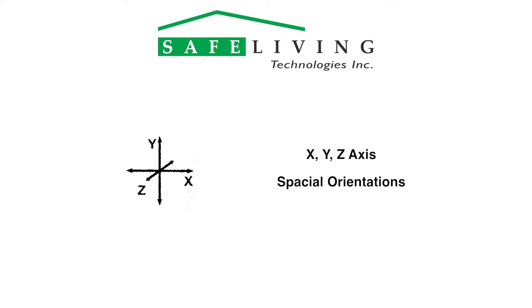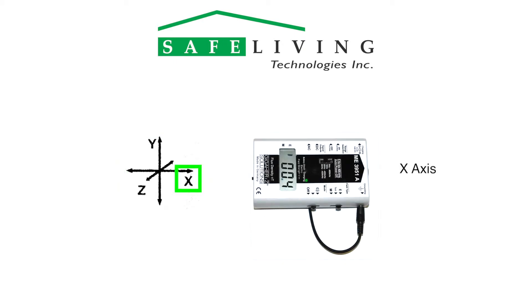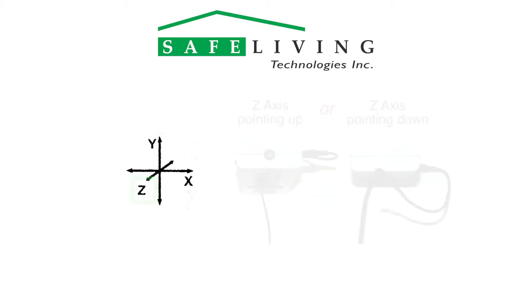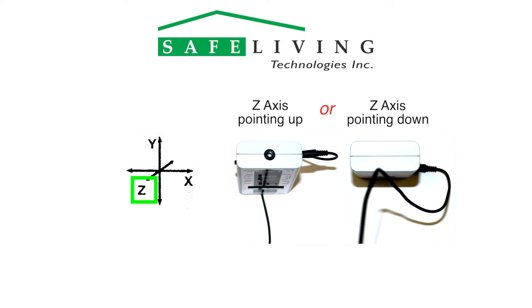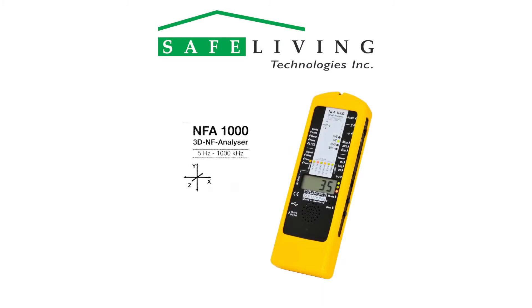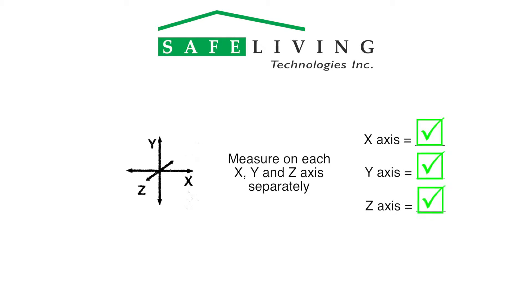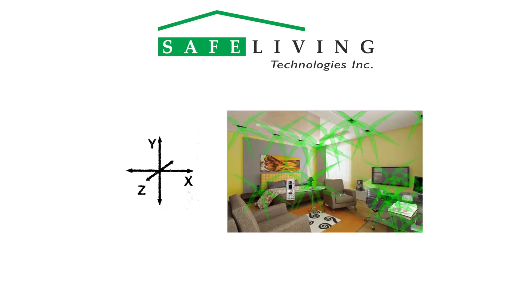The X, Y, and Z axis terminology used refers to spatial orientations shown here: the X-axis, the Y-axis which is 90 degrees from the X, and the vertical Z-axis. Note that unless you are using a three-dimensional meter such as an NFA-1000, all electric field measurements must be made on each X, Y, and Z axis separately. Depending on the source position and type of appliance, the radiation field patterns may be present in many directions at the same time.